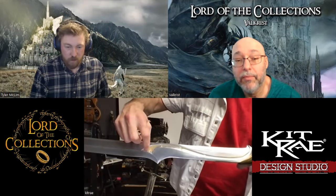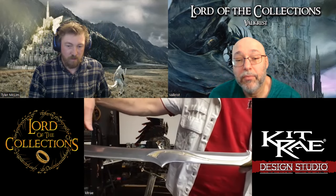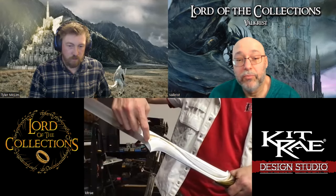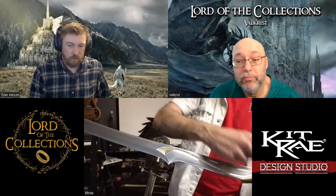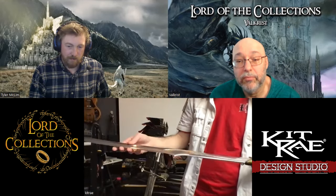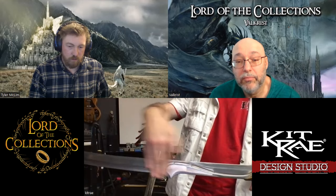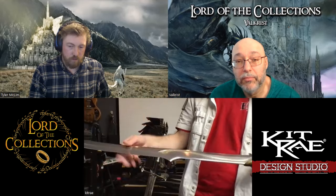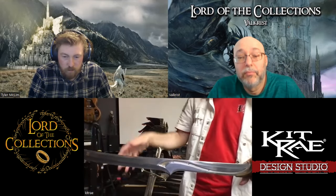You can mill that and CNC it, but we can't really do that in production. Doing a fuller groove that is straight or even with a slight curve on a milling machine, that's no problem. This stops before it hits the blade grind, curves and tapers to a point. I know I'm going to ask them to try it, but I know it's not going to work. So what we're going to end up doing is probably stamping that whole thing at one depth to get the exact shape of the groove that we want. We'll etch it in there just like this, but this is probably going to end up being a stamp instead of a curved groove.